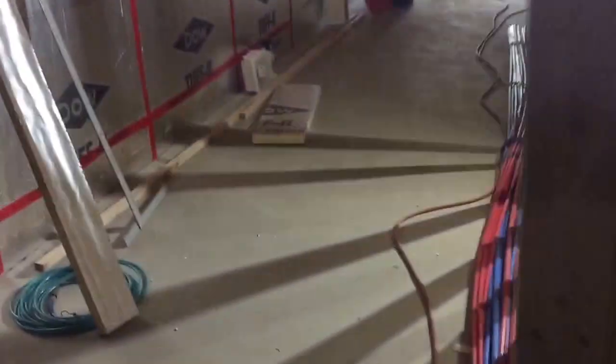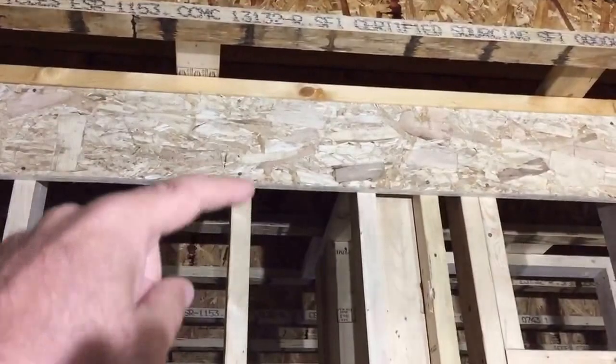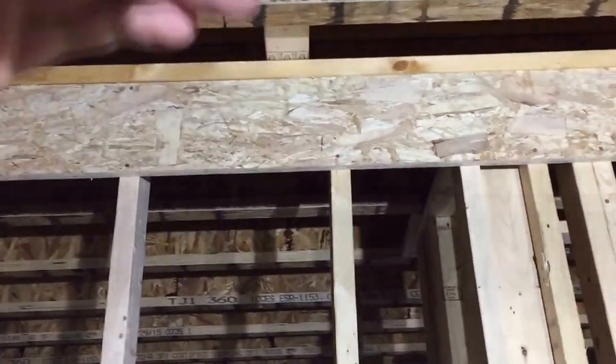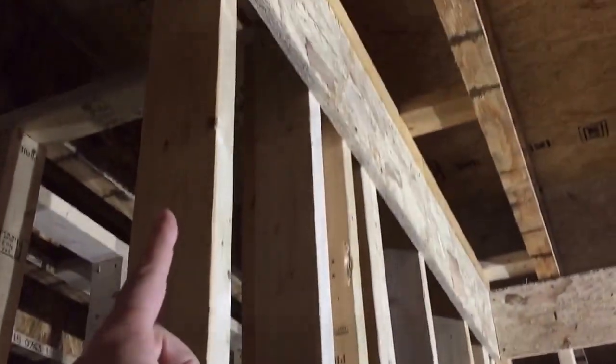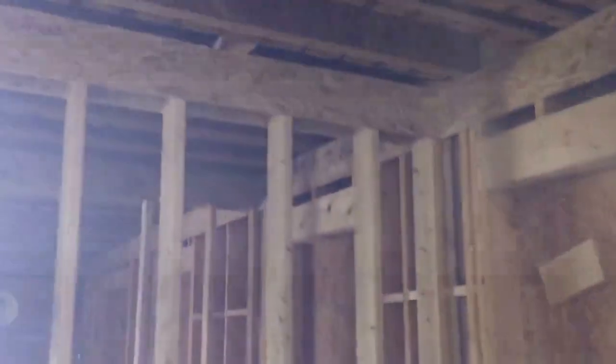We spoke in an earlier meeting about fire blocking going on down here. Here's what I was talking about. The drop ceiling is 8 inches in here. And it just comes horizontally through this wall and turns over. This piece of 3/4 is 8 1/4. So that provides, when we put the ceiling along the bottom of this, and the ceiling in here goes to the bottom of this, that way fire can't get up through the stud bay and into the flooring cavity. So we have to have that. So do that everywhere. All the downstairs rooms. And the hallway is eventually going to get it, but it hasn't yet.